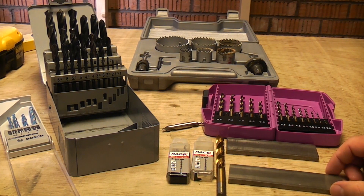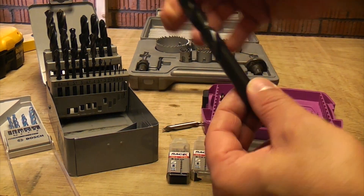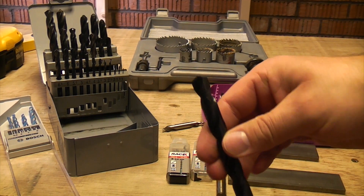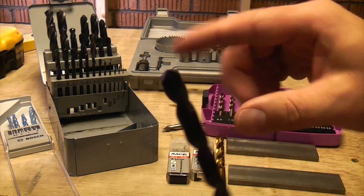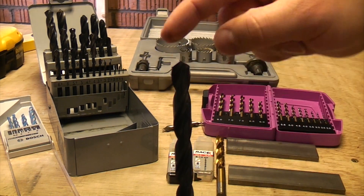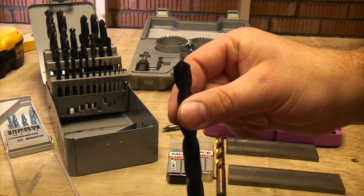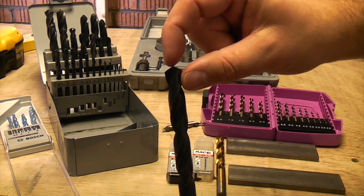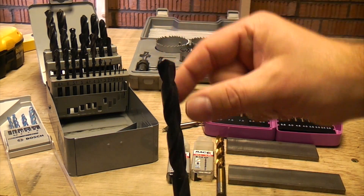The main things to watch for are making sure you get the right drill bits. These, for example, are only for use on metal — if you use these on wood you're just going to blunt them straight away. The actual tip of the drill is ground to a specific angle and it's designed to cut efficiently, so if the bit starts going dull or if you lose the angle it's not going to cut as efficiently.